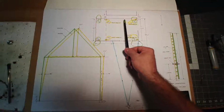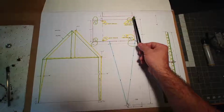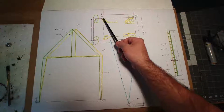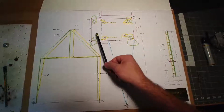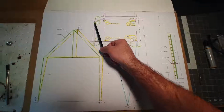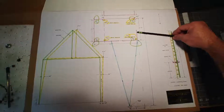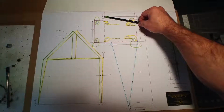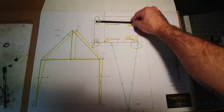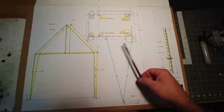I began by laying out the footprint of the building, making measurements of the length of the sides as well as the neighbor building, and I got distances between the two of them. It established for me that the true width of the building as designed and built was at the back, and the length was the same overall, but at the front it has grown wider, and the distance between it and the neighbor building has grown smaller. So it seems to me that this wall at the front has migrated out, and we established that by measuring around.